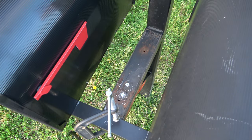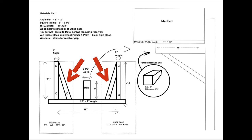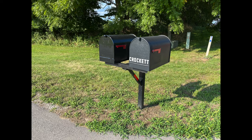The boxes and bracket looked good. However, when I went to open and close the doors, I noticed the boxes were bouncing. I knew I had made a mistake of leaving out the angled supports. I returned the unit to the shop and added the much-needed angles that I originally had in my plan. This solved the bouncing issue and definitely made a solid final product.